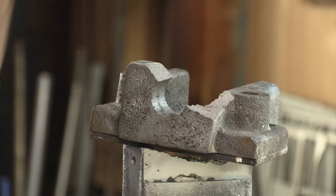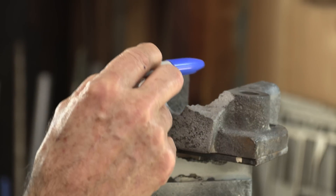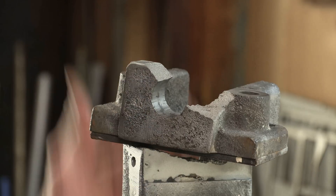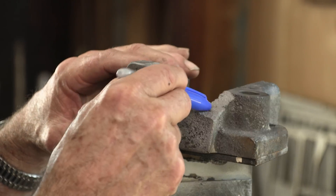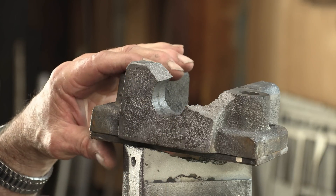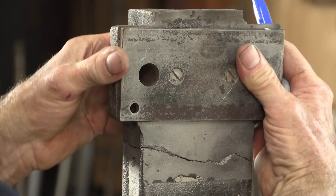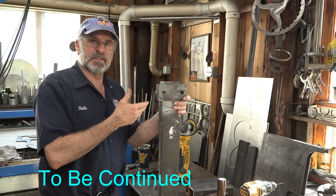I think I'm going to completely leave those pieces right out of there, and I'm going to braze up this surface right on over to here before I put this piece onto the other piece. I'm going to use this bore to run the rod through and ensure we have alignment while I'm brazing the other break. So we're going to fix this one here first, make sure we have the shaft fit in here, then assemble the thing with the shaft in it and the break prepped and braze that together. Stay tuned for our next video where we'll get into the brazing. Get her done.